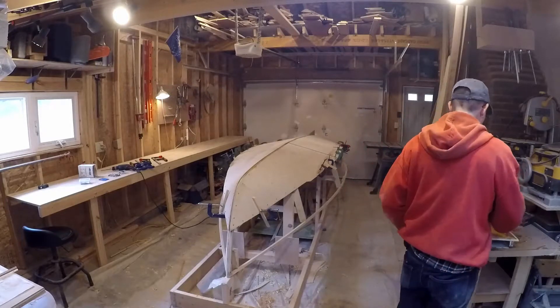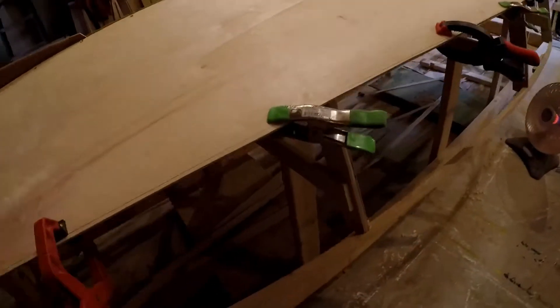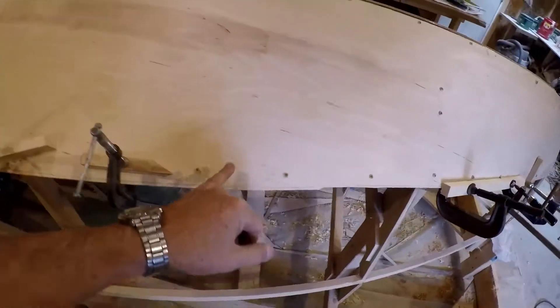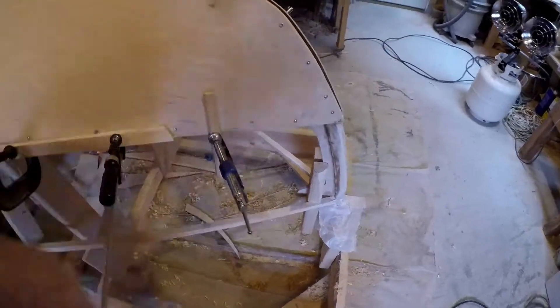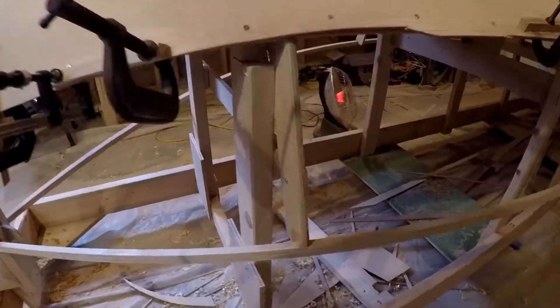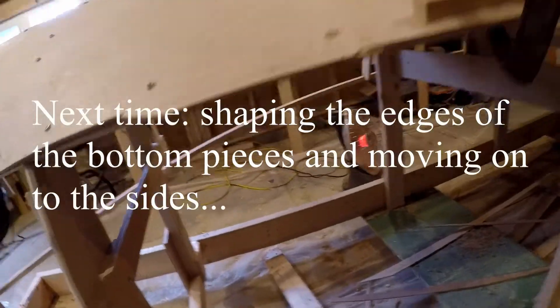That's going to have to be good enough. I think it's in the proverbial good-enough zone. Look along here — this laid so nicely. I've got these temporary screws that I use as clamps where it's really hard to get clamps. It's a pain to fill the holes later when the screws come out. I use brass just in case I can't get them out, but they're not very strong. So up here where I was really torquing, I used the pocket screws. Other than the difficulty in carving this exact line after the fact, I think you can go back to the simple method from here. Pretty good.